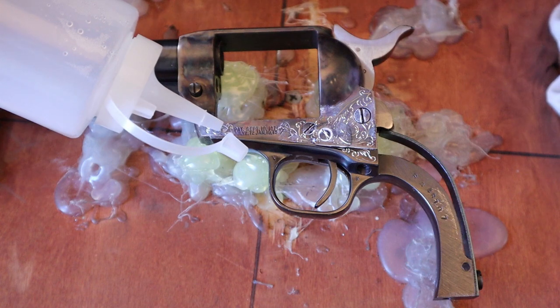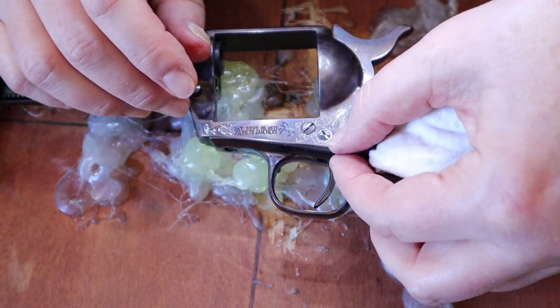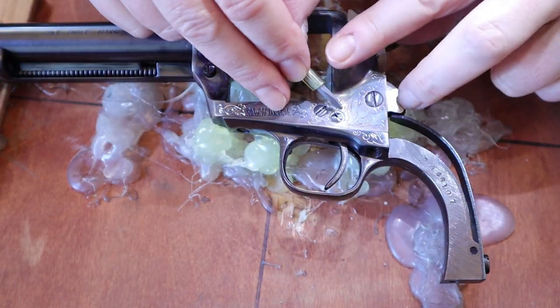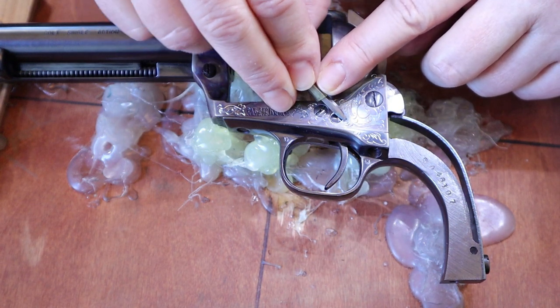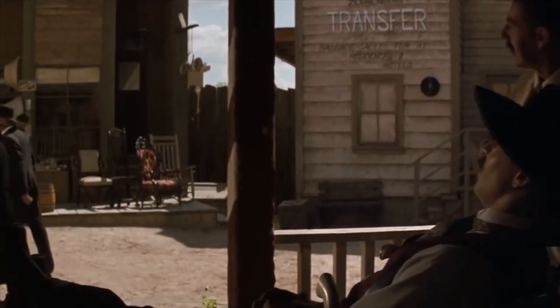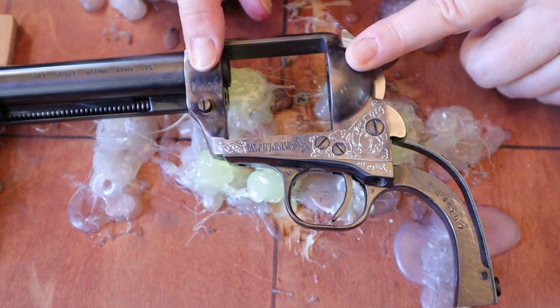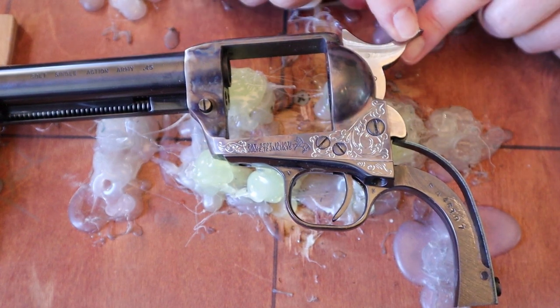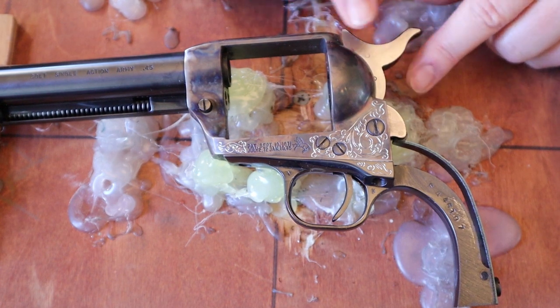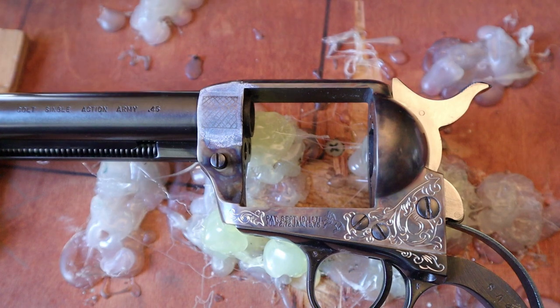Let's take off the white paint and see what the result is. I feel a little burr, so I have to go back in. The engraving should feel smooth — no little raised metal burrs that weren't completely cut off. This looks good. Now we're going to do the ball, the front strap, and then the hammer — the parts I need to finish while it's glued in this position. I take a snap and send it to the owner so he can see the results.